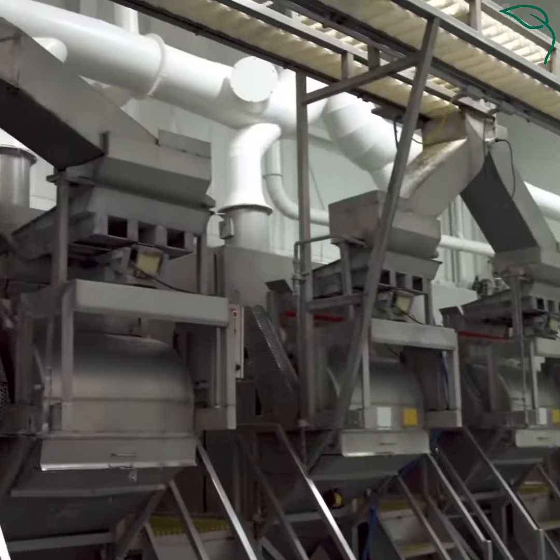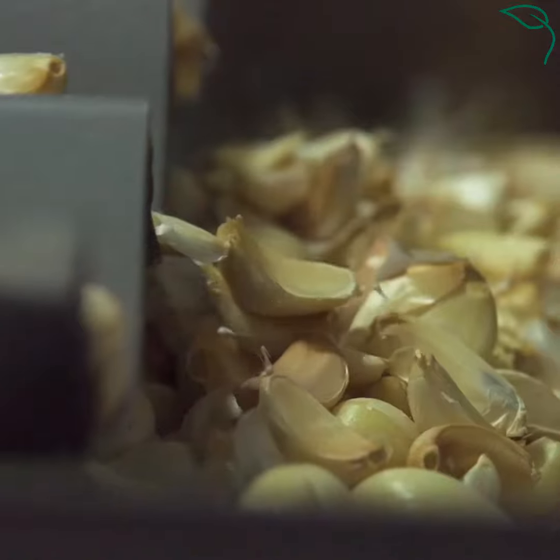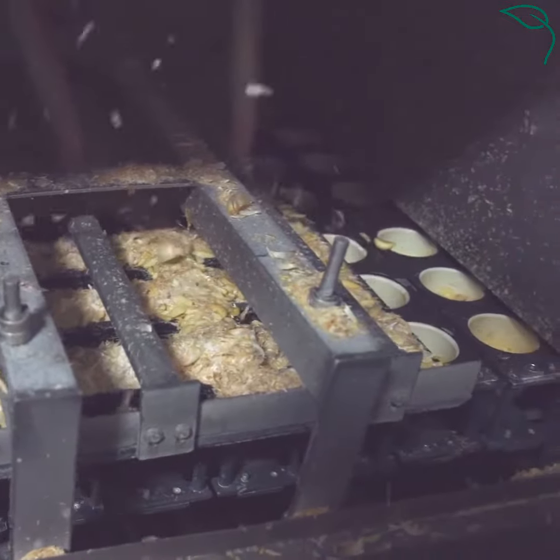Sometimes you're going to have bulbs that are a little bit cosmetically deficient — we're going to call those bulbs off-grades. The off-grades are run beneath a series of rubber rollers, which physically breaks apart every single bulb of garlic. The cracked cloves of garlic are poured into a series of cups, the machine fires a stream of air into every cup, and the garlic whips around so the skin just falls right off.